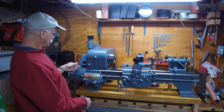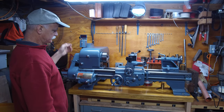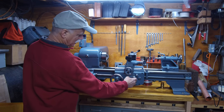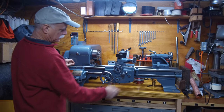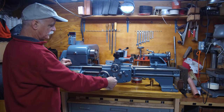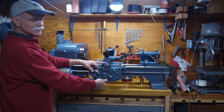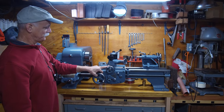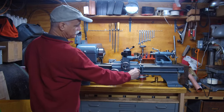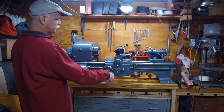It has feed. It has a clutch mechanism that can drive the carriage in the X axis, or you can flip it and drive the cross slide sideways in Y, or you can put it in neutral and use the half nuts and do threading. Three different positions, and those can all be switched while it's running.